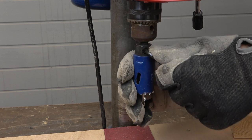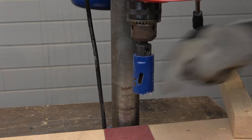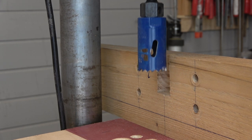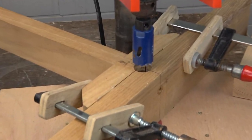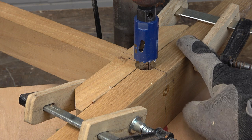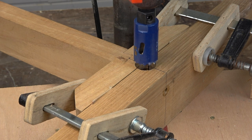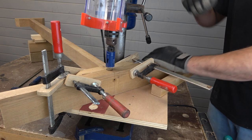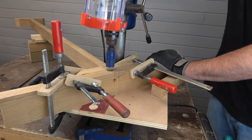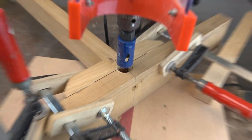But this time I have to take the centering bit away. I set the drill press depth stop. I set the wooden base in the drill press — notice that here there are some seams to separate the pieces to each side of the hole. I center the hole saw and make a mark using the hole saw, just to make sure it is well centered. Then I drill the hole with the desired diameter.